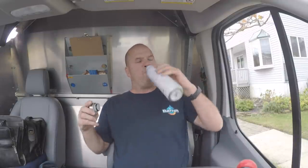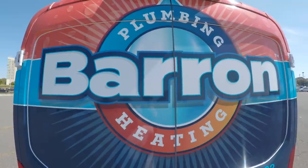And for today's plumbing adventure, we have a leak on a ProPress heat line. We're going to get the shots because I think it's not all the way on. This is why you got to mark your pipe and double check your press before you actually press. See you inside.